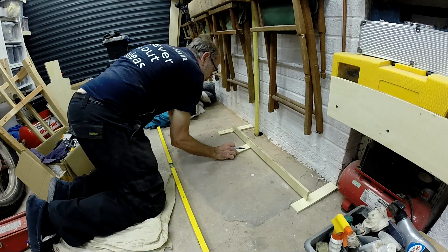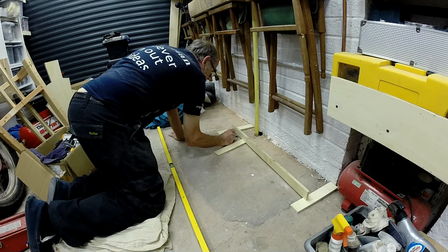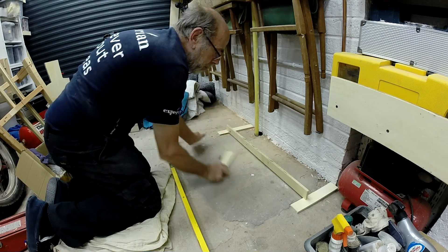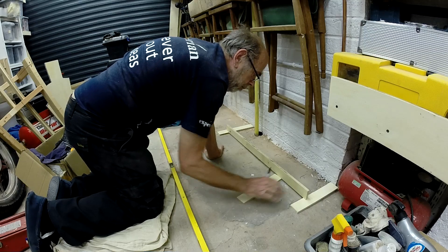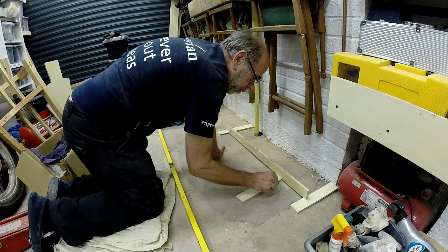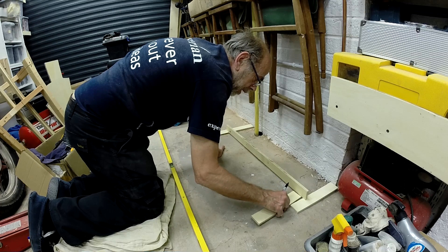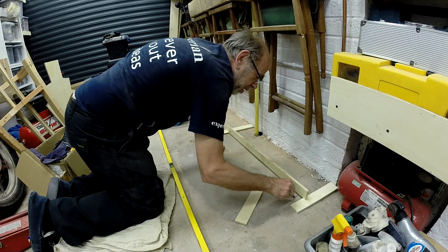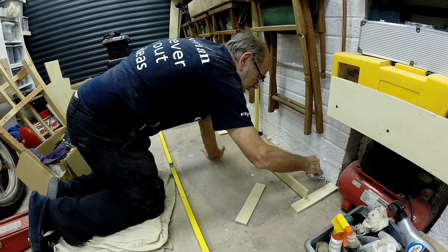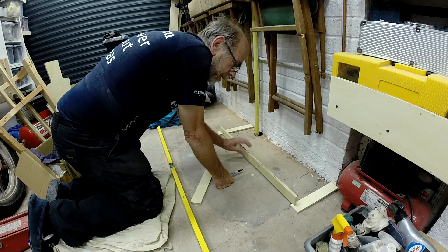It's not all over — in fact it's slightly low in some places. But there are areas that are too high. I didn't want to end up putting five or six millimetres of levelling screed over the whole floor just because there are a couple of areas that are slightly high and could be taken out. So I'm going to use the SDS drill with a chisel in it.